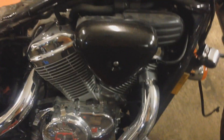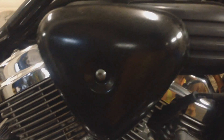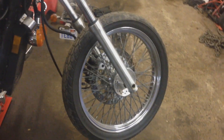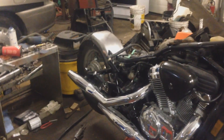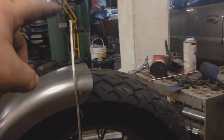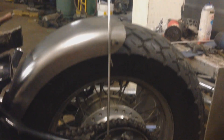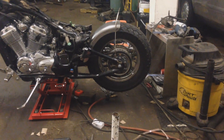We did some powder coating as you saw earlier. This one didn't turn out as shiny as I thought — it's a little rougher, I should have put more powder. But it's kind of cool; it sparkles in the sun. I did my new pegs like that. I'm going to do my wheels regular gloss black, both wheels. Right now I've got the first bar bent and following the shape. Once both sides are welded together I'm going to put them in the vice and make that bend at the back. I'm going to tack all this together — man, that looks awesome.